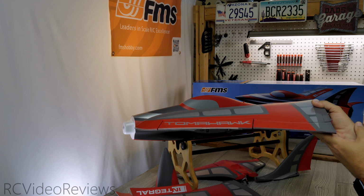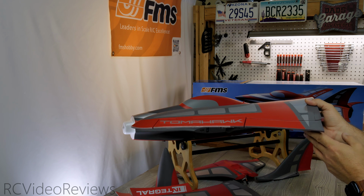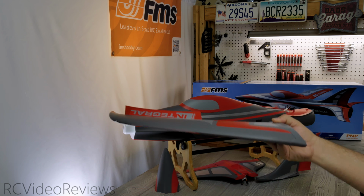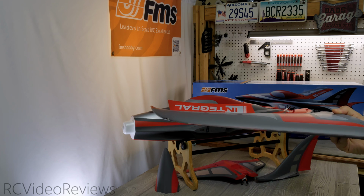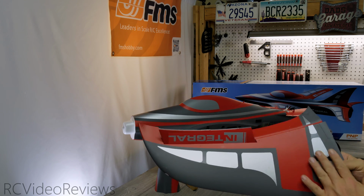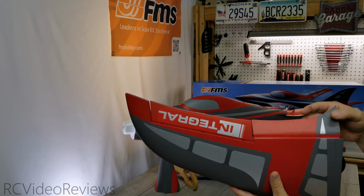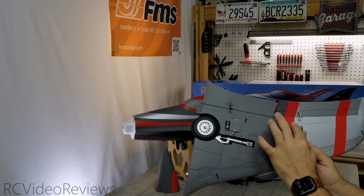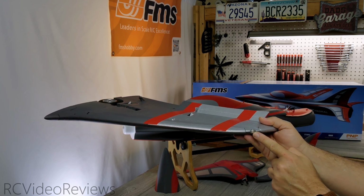I'll just line up the aileron, and you can see how it lines up out there on the tip, and then when the flap is in the full up position, you can see a nice alignment there on the trailing edge as well. We'll take a quick look at the starboard wing. I won't go through all the same detail. We'll just take a look for quality. Everything looks good there. I don't see any problems on the top. The control surfaces look like they're in good condition. They move freely. The hinge moves just fine. Everything's covered and taped and screwed down. And we've got our navigation light out here on the tip as well.